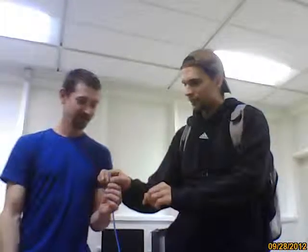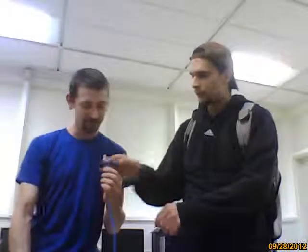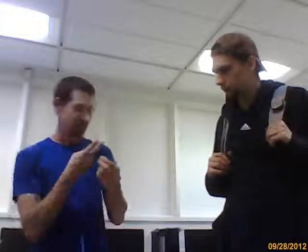Yeah. See, I was starting with this much slack because I wanted to be able to get the casing, the insulation up in there. See, I jinxed it because I said no pressure. I got one end good. Right. And the key is, it is not uncommon when you go to slide your wires up into a connector that you have to check your pairs again, because sometimes they'll jump. Yeah. So I should have looked at it before I cranked it for sure.